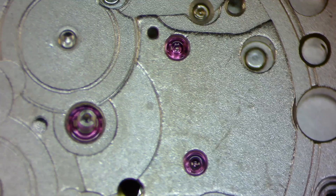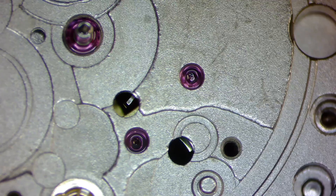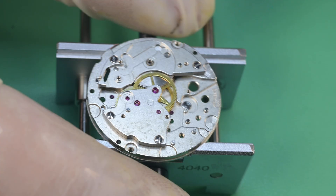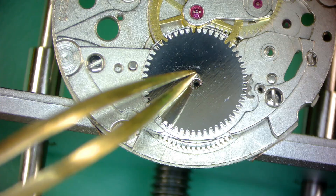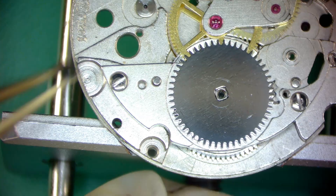With the crown wheel in, you can see a very clear shot of those three slots cut into that screw head — whenever you see that, it's immediately reverse thread. It's a mental block you have to get over because your entire life you screw things right to tighten them, but not that one. With the wheel train in, I'm going around with my fine tip oiler looking at end shake on these things, giving everything a once-over to make sure everything looks good. It's somewhat difficult because the wheels spin on you, but everything looked good. So now we're down to installing the pallet fork — getting it set into place very gently, making sure we don't break anything, then getting the bridge on.